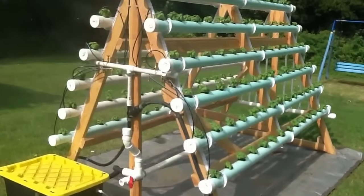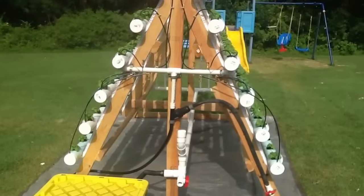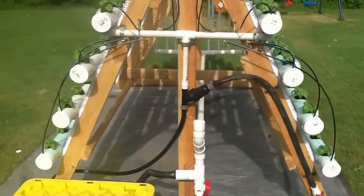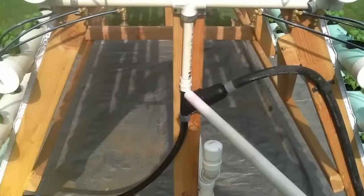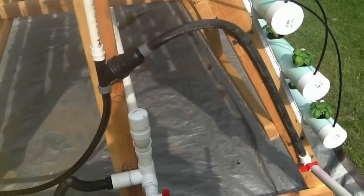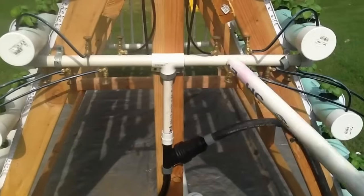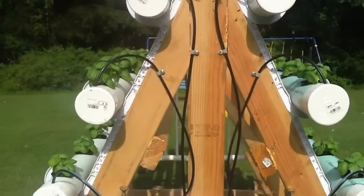Starting on this side — this is what the delivery system is. I have a small reservoir here attached to a larger reservoir, with a float valve. Our water comes up this line here to a filter. This filter has a ball check valve on the bottom where I can just open up and flush out the filter. It comes up here to a manifold. I had to put these little valves in here afterwards because I found out that I was dropping pressure when I went up to the top, and too much pressure on the bottom.